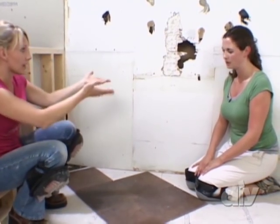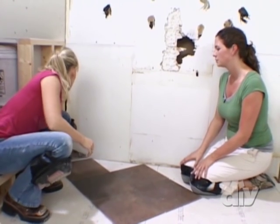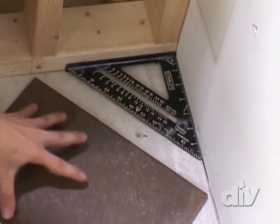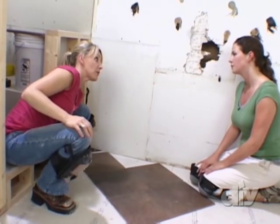Well, one thing that happens when you're doing a diagonal pattern on the floor is that it just becomes a little more time consuming. You're going to have a lot more cuts, which is fine because you're getting really good at the tile saw. Every time you hit the wall, you've got a triangle cut to make. Other than that, it's a pretty easy layout and we get it by putting down our speed square in the corner. We know this corner is square and then we'll measure off of this line and set our first tile far enough so that each of these corners clears the wall so that we don't have to make a cut.